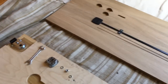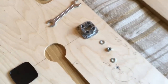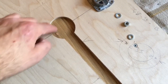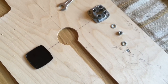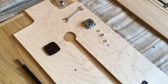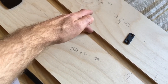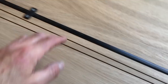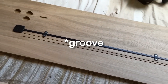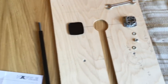On the jig you can see some workings-out where we were figuring out the right combination of router cutter and bushing. What we settled on — partly based on what we had — was a 6 millimetre cutter in a 20 millimetre bushing. Our first attempt had us fixated on the final cup size of 35 millimetres like a hinge, using a 12 millimetre cutter and 30 millimetre bushing, only to realise the 12 millimetre cutter wouldn't cut the required 10 millimetre hole. So we had to go to a smaller cutter and smaller bushing.